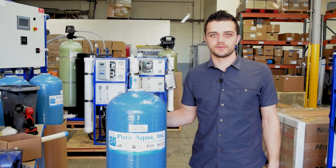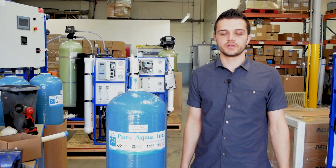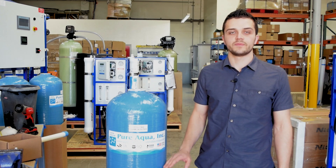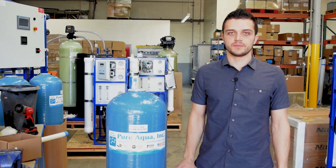This particular demonstration involves a 12 inch media tank. There are many different sizes of tanks with many different types of media, so it's up to design calculations and criteria to determine exactly the quantity of media needed and gravel under bedding quantity as well. Here at Pure Aqua we've done our specific and precise calculations for our media sizes and tanks to make sure our design and flow rates are adequate for each tank size.